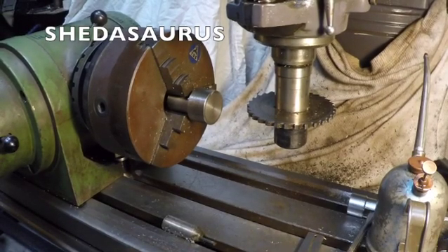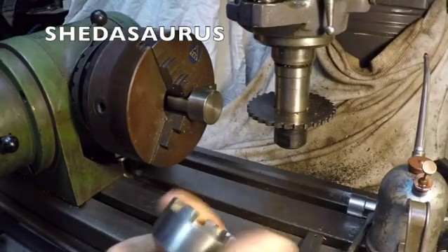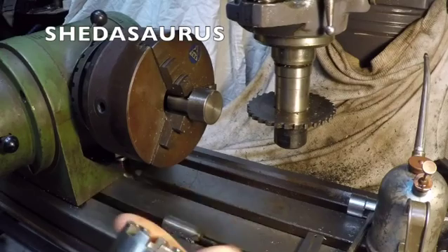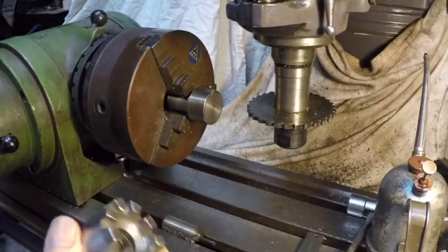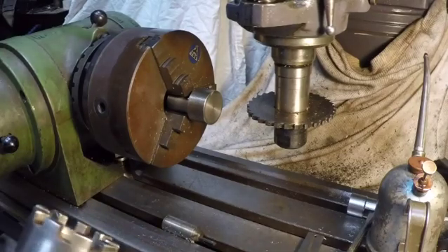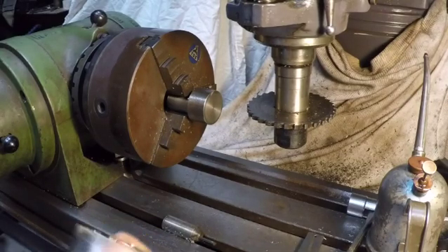Firstly, I'll give you some info. The milling cutter I'm using is 3/16 or 4.7mm. The outside diameter of the original size on the UK Bridgeport — it's probably the same on the American — is exactly 1 and 5/8 inch. Now that's a hard size to get, so I've whittled it down to 1 and a half inch, and it just goes just as good.